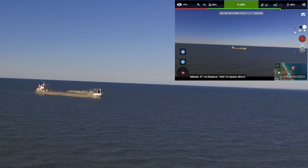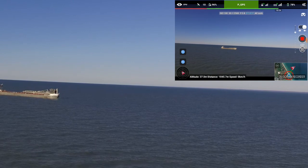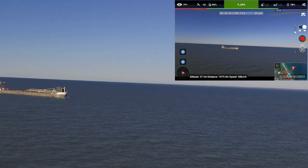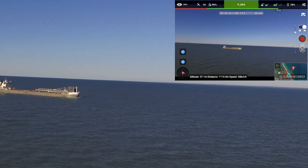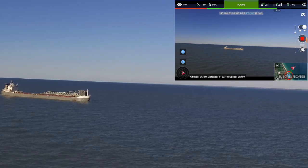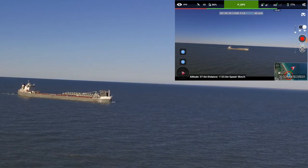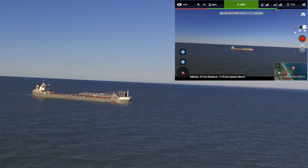Let's pan around a little bit and take it out further — let's get it out to about 1,100 meters. Crossed 1,100 meters. I'm at about three bars, up about 36 meters. See it's bouncing the signal, but now I'm back up to three. I'm thinking with the lake I should have a really good ground plane out there.